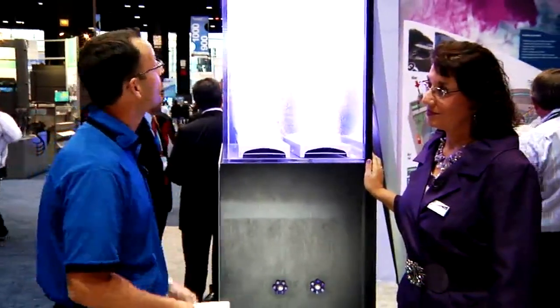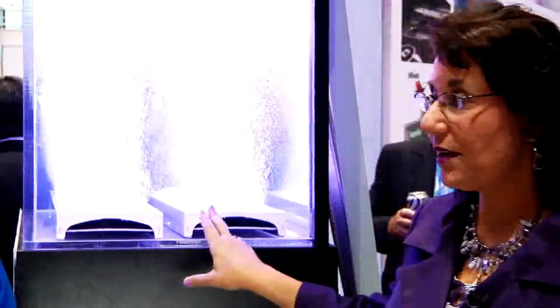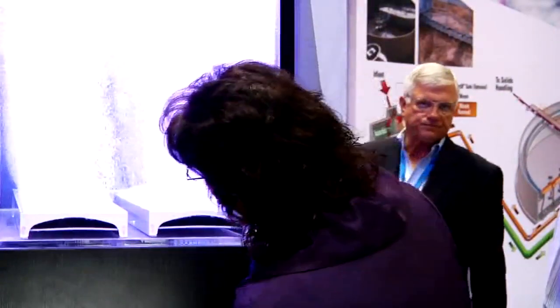Elena and Ovivo have a lot of new technologies here at the booth. We've shifted now to another place — we're in front of the AeroStrip diffuser. Elena, is this the same product that's underneath the new OV400? Yes, this is a great example of taking products that are wonderful in one area and applying them in others. AeroStrip is being used on the bottom of our ClearTech IFAS, on our MBRs, and also for conventional aeration, SBRs, whatever that may be. What's unique — as you can see here, this side has a much lower airflow than this side. You can actually turn the air up and down. It has a 24-to-1 turndown, which gives us tremendous capability for a wide range of fluxes, airflows, and distribution within the tank.